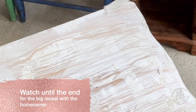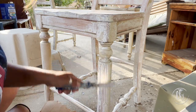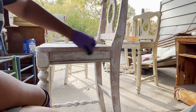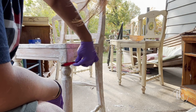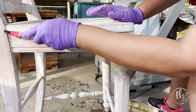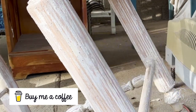It was not easy getting these chairs down to bare wood. I now think it was not latex paint but enamel paint, plus the polyurethane and the primer, which I wasn't expecting. I don't really prime my furniture unless it's a bleeder and I use shellac. This stuff was a soupy hot mess — it just would not come off. I tried so many different techniques and it took forever. Eight chairs, the big table, the leaf — it was a nightmare, literally back-breaking, and every time I thought I had it done, I would have to go back and take more off.